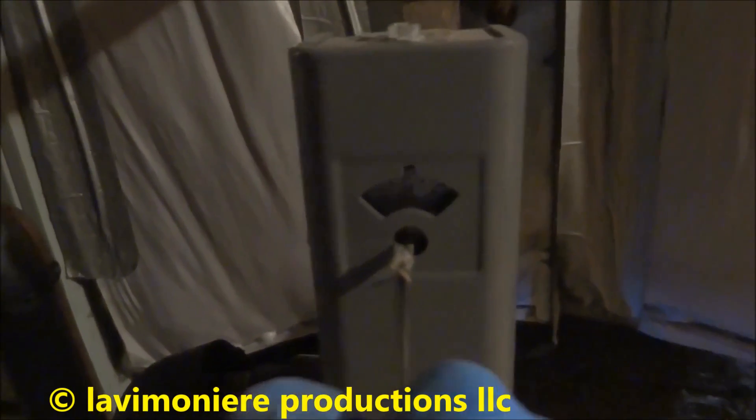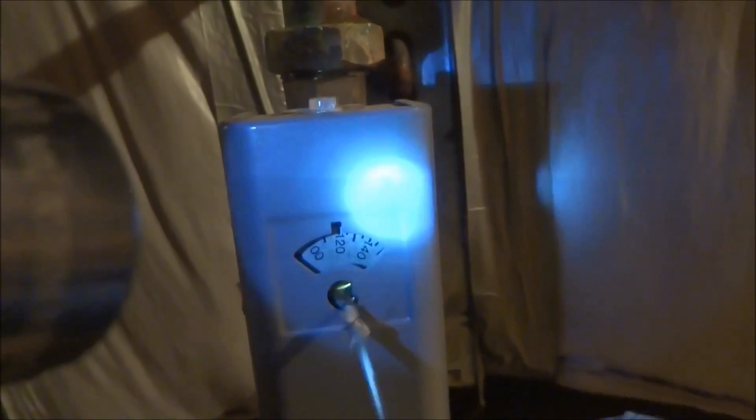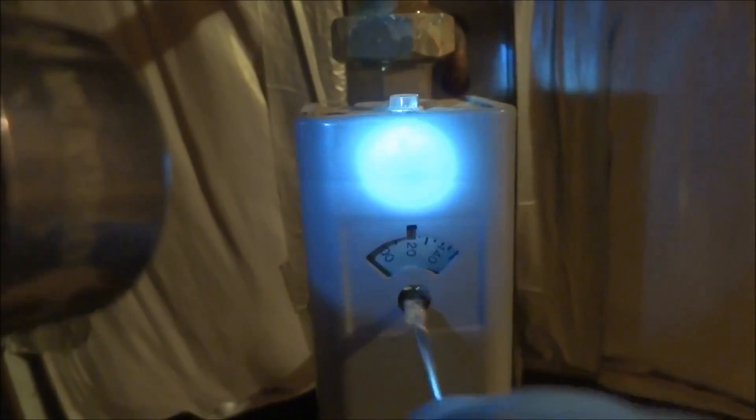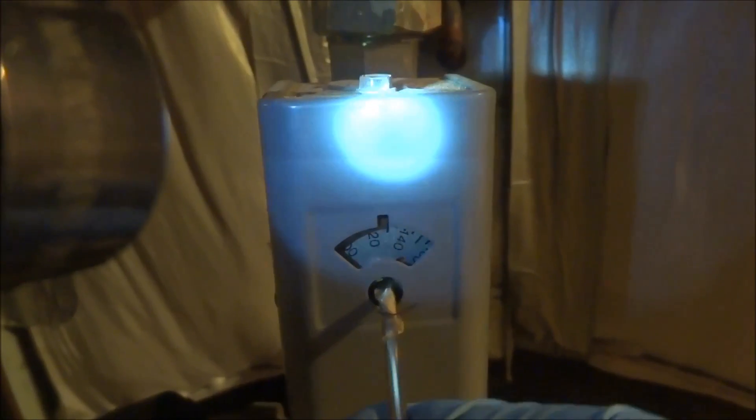There it goes — that was easy. We'll put them all at 130. When the pipe heats up to 130 they'll kick in. I know the hot water's going through the coils, but the fan wouldn't come on so I couldn't get any heat out. I've got to tighten up this plug — this cap here is leaking a little bit.